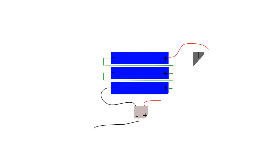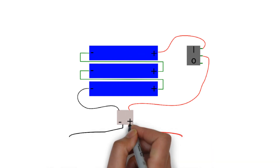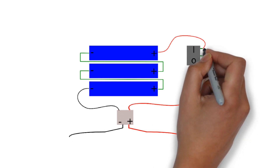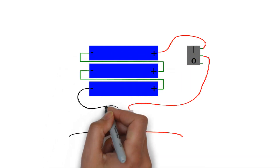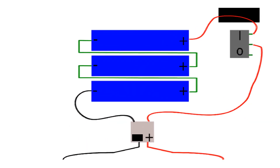The wiring diagram for the portable light is fairly simple. The negative comes in from one side into the terminal block. Either the negative or the positive — doesn't really matter — goes to one of the poles of the switch. Then the other wire goes to either the positive or the negative depending on which one you've chosen. The other side of the terminal block simply connects to whichever one's left over. In my case the left side is the negative side. The 18650s are wired in series, so just make sure you've got your positives and negatives connected to each respective side, giving you a 12 volt battery.